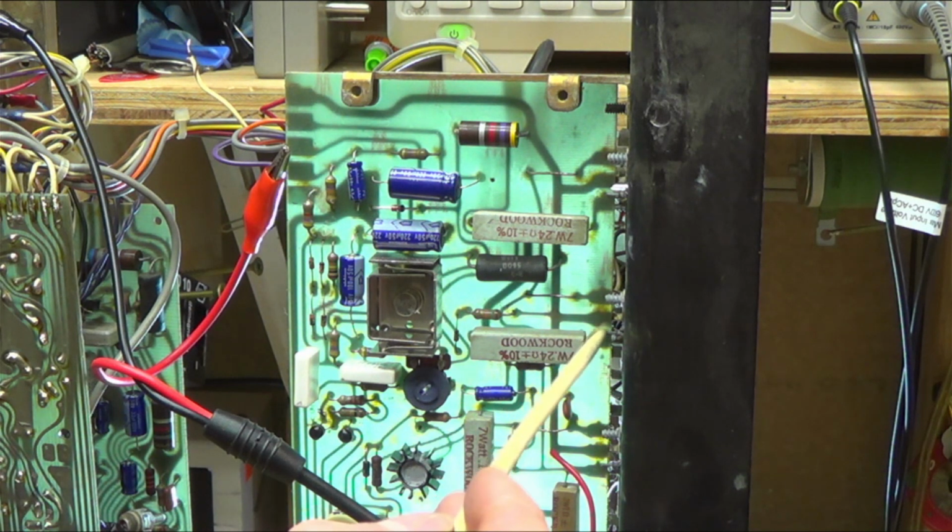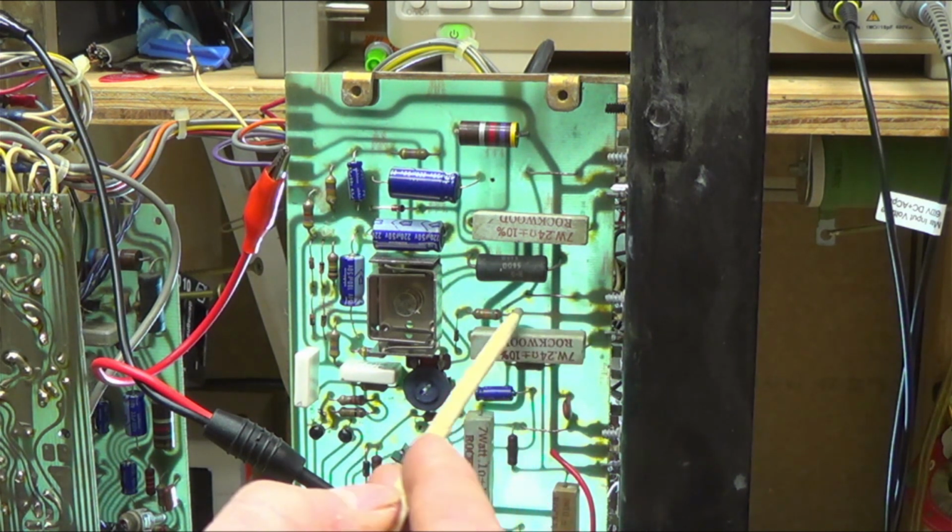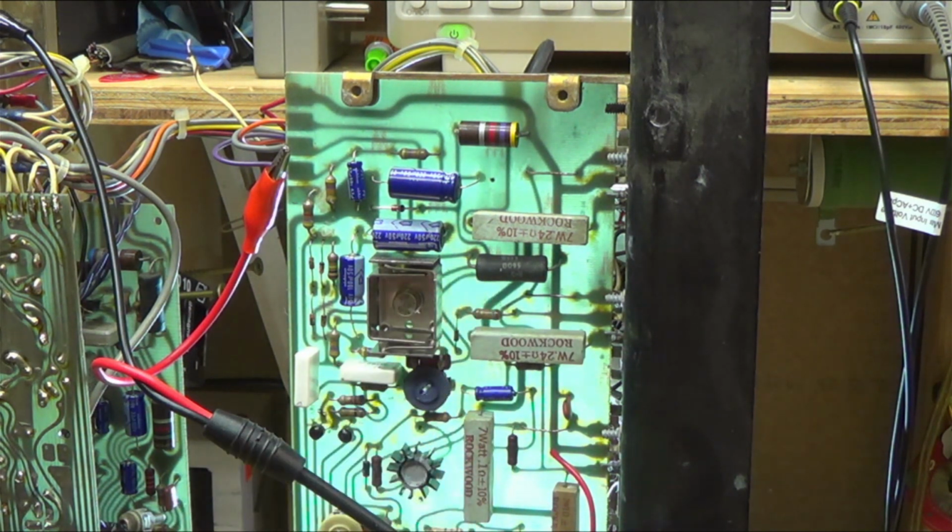You can see everything, but here you have the 92 volts going to this. Let me see what we got. So this is our 408, and we need to go from 15K to 14K here. And we come through this diode into here. We need to pull this, and then right here, this is 403. We need to go from 47K to 100K. That shouldn't be too hard.